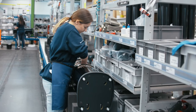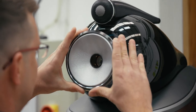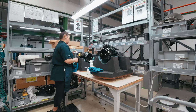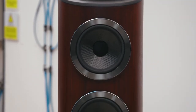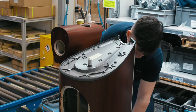One of the things you'll notice as you go down the final product assembly line is none of the operators are wearing gloves — that's deliberate. We encourage people to remove jewelry, and if they have wedding rings they must tape them up so they can't possibly damage or mark the product. Human skin is actually a really good way of handling a product and making sure you can't drop it. It does deposit fingerprints, but all we do at the very end is clean those off before the product is finally packed. One key difference with wooden cabinets is they are created from the start as pairs — the veneers are bookmatched left to right and travel around the whole factory as paired loudspeakers.